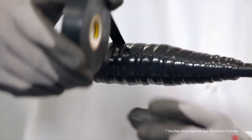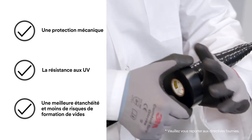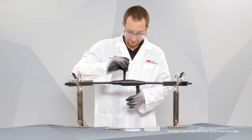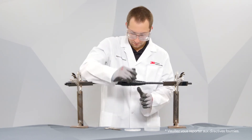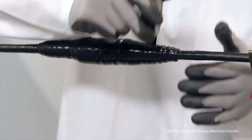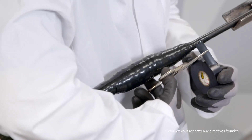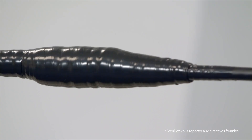Super 88 also provides UV resistance and helps create a better seal. The last inch should be wrapped in a more relaxed manner under no tension. You also want to make sure you cut from the roll when done — do not tear. This will reduce the chance of flagging.